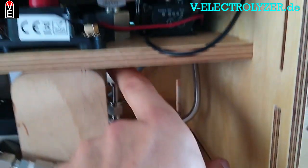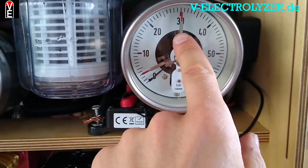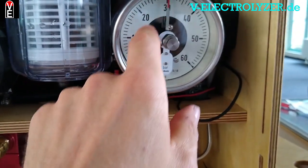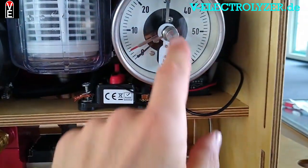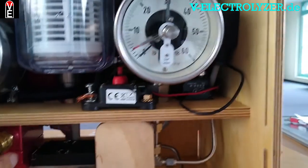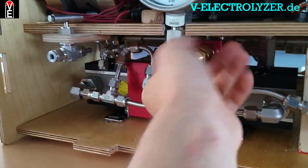The T-fitting fills up the red bottle in the back. The bottle has two liters with pressure. It goes down into the pressure measurement device, which I set up to 30 bars at the top — maybe that was a little bit too high. When this two-liter bottle and the whole piping system reach 30 bars, the magnetic switch will activate the air compressor.